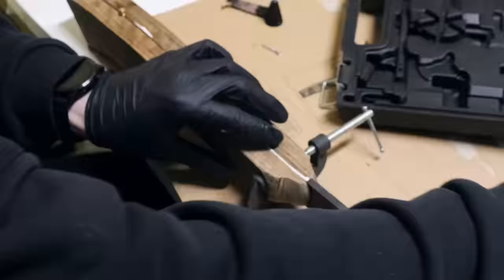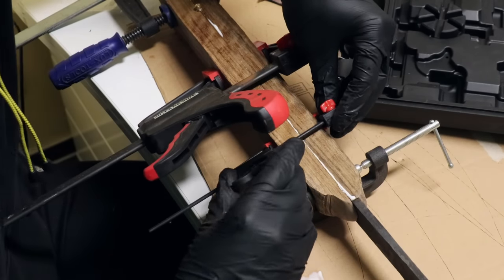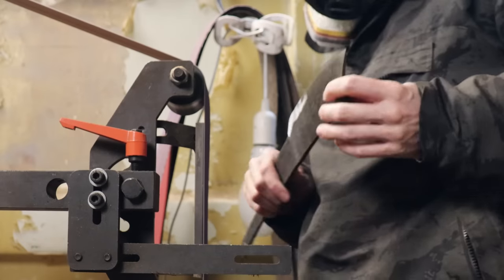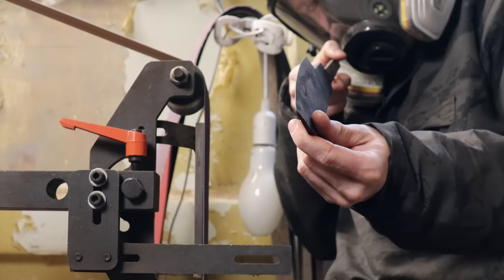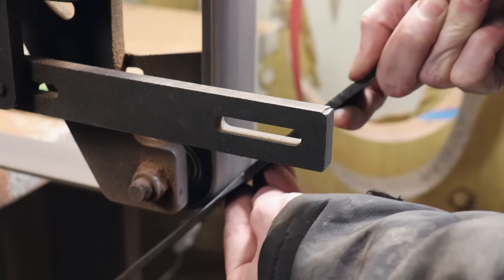Since both of these blades are meant to look like opposites, the one I just glued up is meant to have the blade blackened. And this one I'm currently finished grinding will have the shiny counterpart. To achieve that silvery look on the forged finish, I'm using this worn out conditioning belt, which actually worked quite nicely.